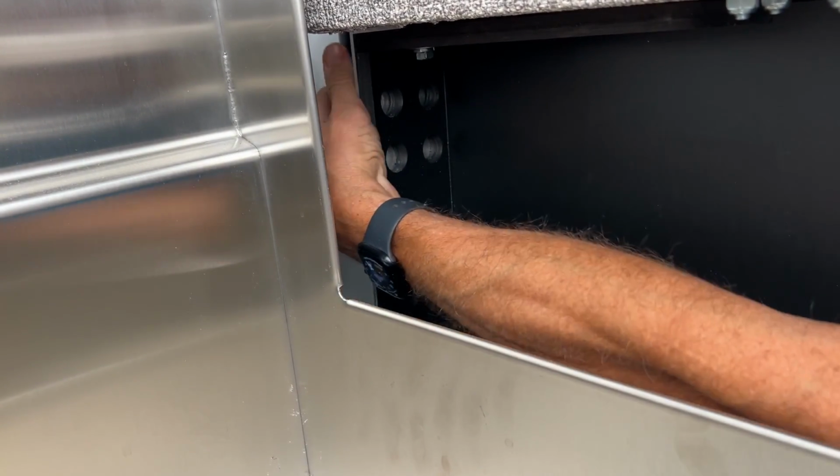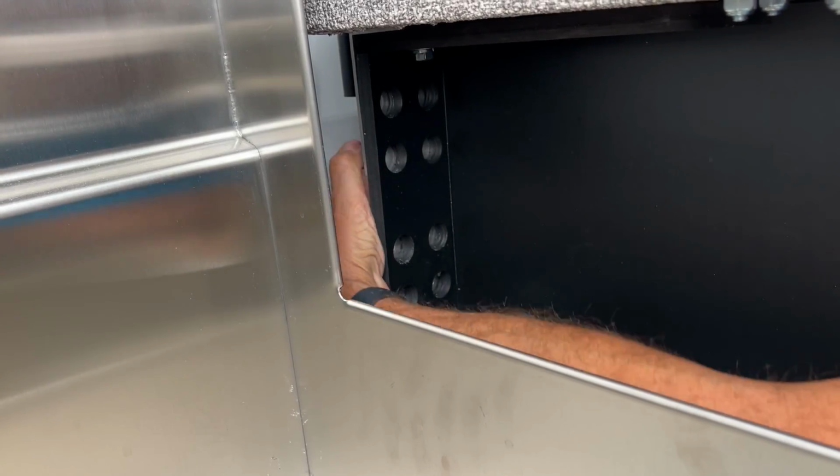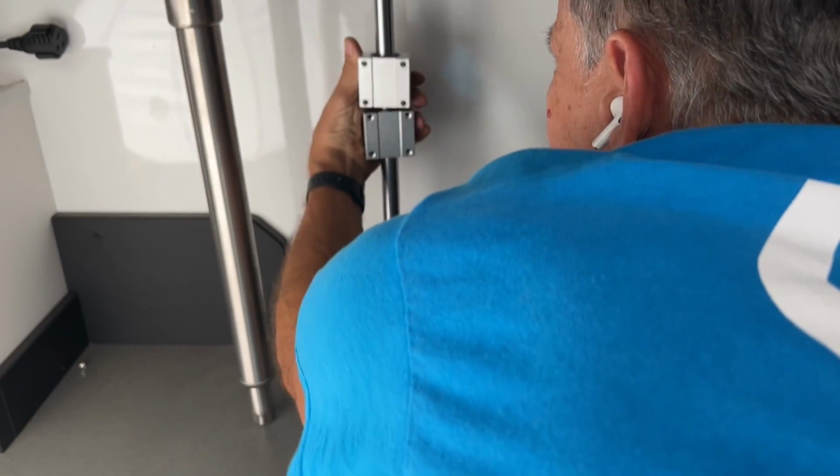Now let's loosen the bearings and then get under the table and slide the bearings all the way down off of the rail. Now grab your new bearings, and make sure you don't grab your old ones. Put them on the rail. As you push the first one up, let it go up far enough so that the black box holds it in place. Then slide the second bearing up and trap both of them at the top behind the black box.